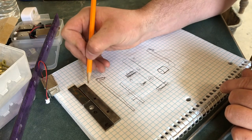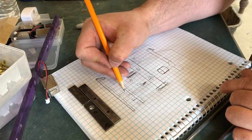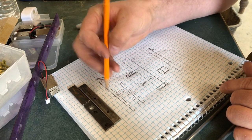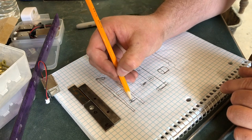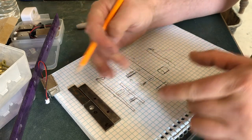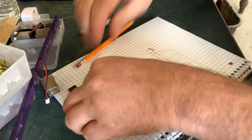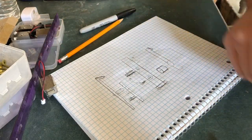Because I'm gonna bend that, cut it and bend it, and then weld it. We'll have a peg coming through all the way. Welded. Actually, I'll weld it on the top so the weld doesn't get in the way of the hole. And then on this peg, I will have a spring, the cotter pin, holding that into place on top. So you push on this and it's gonna release the catch. That's complicated. Let's just go and build it. I got it. I know how it's gonna do it. Let's go.